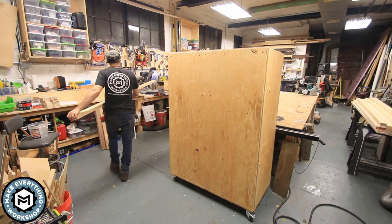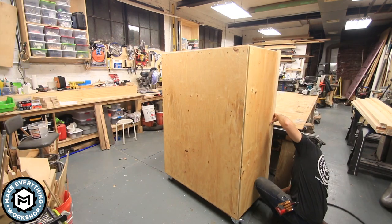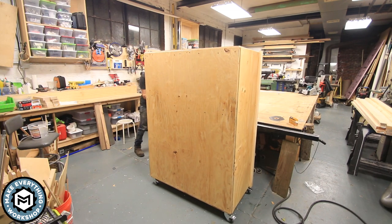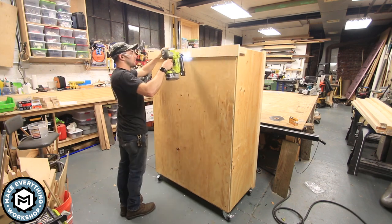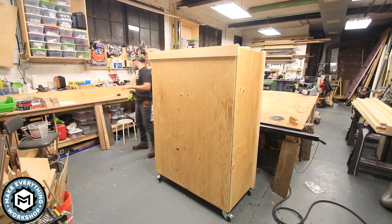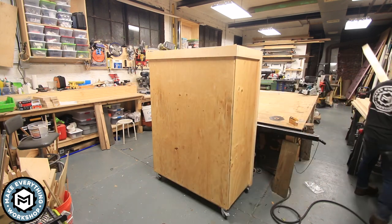Now with the box totally sheathed, it was time to trim it. I'm using one-by-three clear pine for some of the trim — the verticals mainly — and one-by-four clear pine for the remainder, which is going to be the horizontals. The idea is that these are supposed to look like rustic crates. Since the dimensions sort of change as you go, I'm kind of freewheeling it — letting the piece decide the size and shape of the trim. I'm putting spacer blocks in, measuring as I go, and basically cutting on the fly and trimming this out like you would trim out a room. For only having to make two, it worked out perfect.